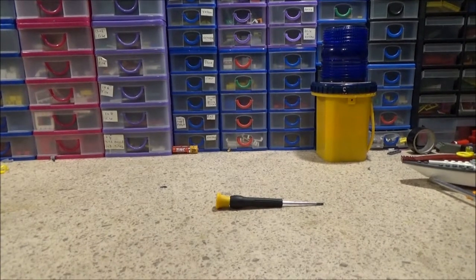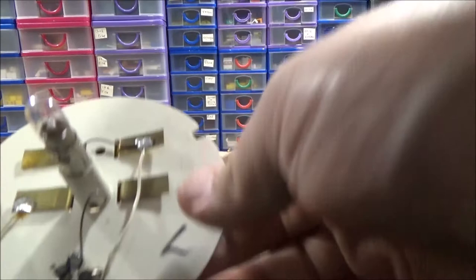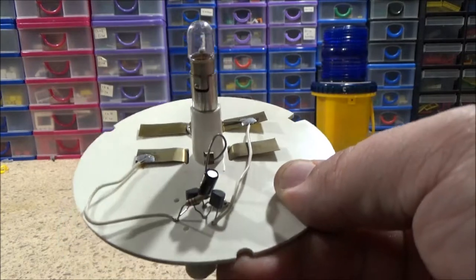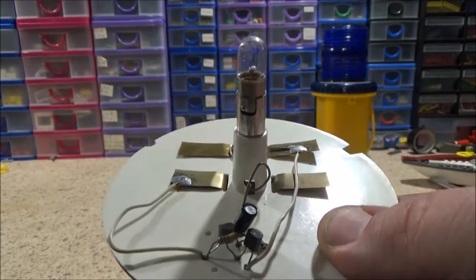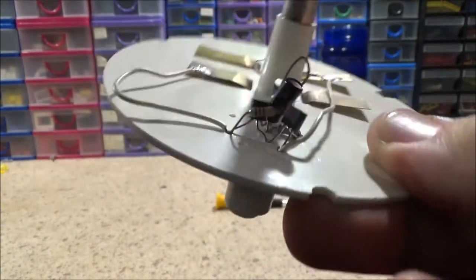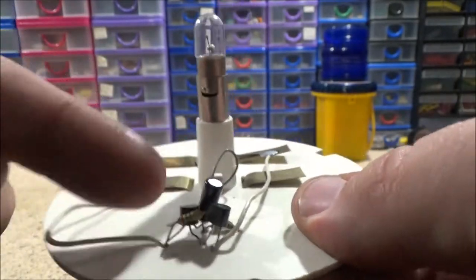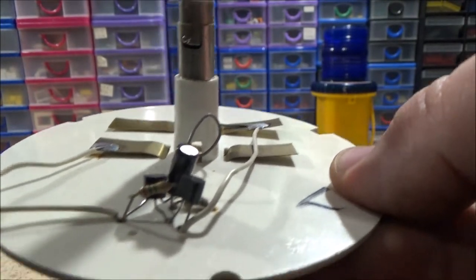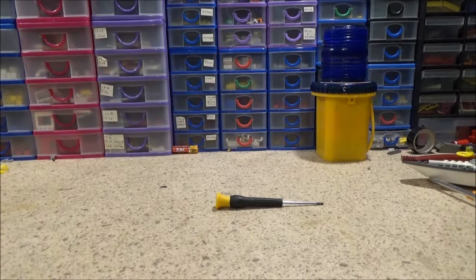Two seconds. Right, so here's an older circuit. They've actually used this as the circuit board, but there it is. It's just off-the-shelf items, as they say. I go on eBay and get all of those and make a flashing light. Simple. Two transistors, two resistors, and a little capacitor. And you would buy these like a pack of 100 for like, I don't know, £1 or something. They're ridiculously cheap for a big job lot of them. Hence why standard lamps are actually the cheapest.